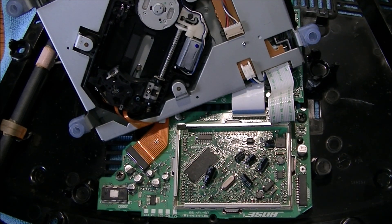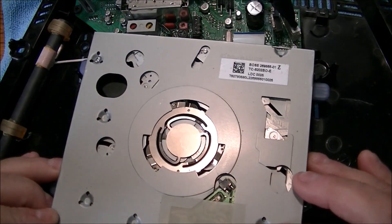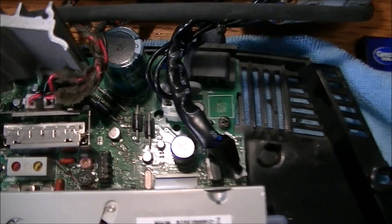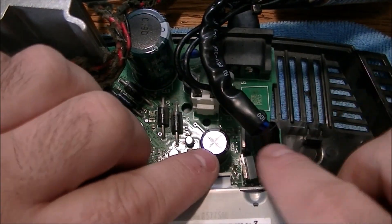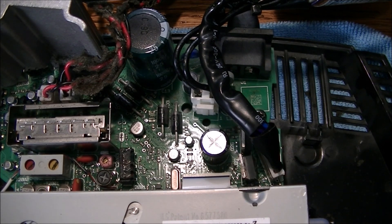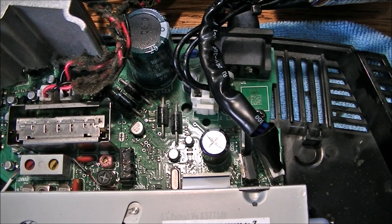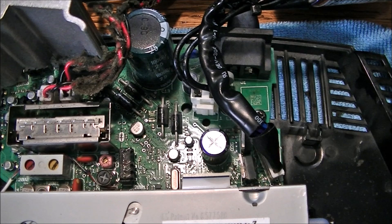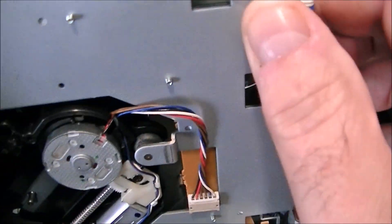I studied the questionable transistor over here, right next to the wiring where the wire arced. I checked base to collector - the reading was 4.5 volts - and base to emitter was also 4.5 volts. I checked it with this tester in circuit and it identifies it as a transistor and it seems to be normal. Other than looking at the board, I don't see anything that appears to have any damage.